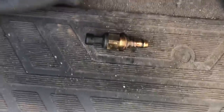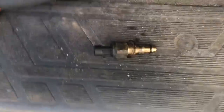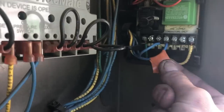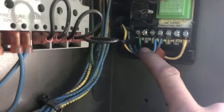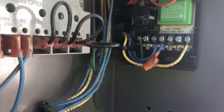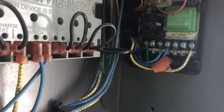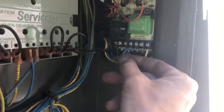We're going to change out the rest of the control with it as well, just so everything's brand new — the customer wants it all done. So we have two blue wires on M and L. I put an orange piece of tape around the M wire so I know what it is and don't get them confused. Greens are ground, and here's our yellow for 240 volts. Always take a picture or draw a picture to make sure you don't mess up the wires.